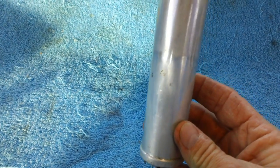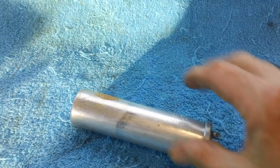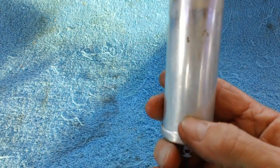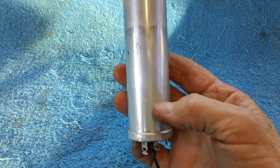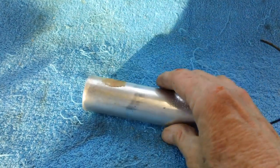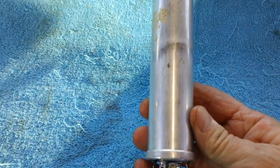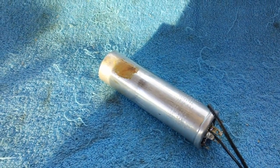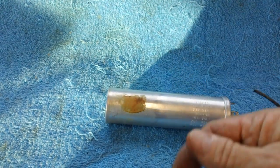From now on I'm just going to stick with cutting the cans open - either putting a terminal strip under the chassis and mounting the electrolytics on the terminal strip, or just cutting the can open and sealing it back together with exhaust manifold tape. You have to cut them fairly low down so you can get a good clean when you remove the top and take the guts out. You also have to drill holes, so you don't want to be cutting it up high - you'd want to cut it about an inch above the seam or top of that bend, then seal them up with that chrome exhaust manifold tape.